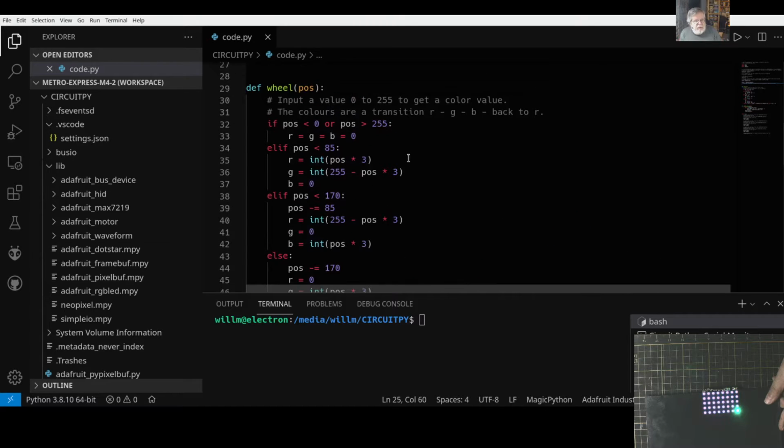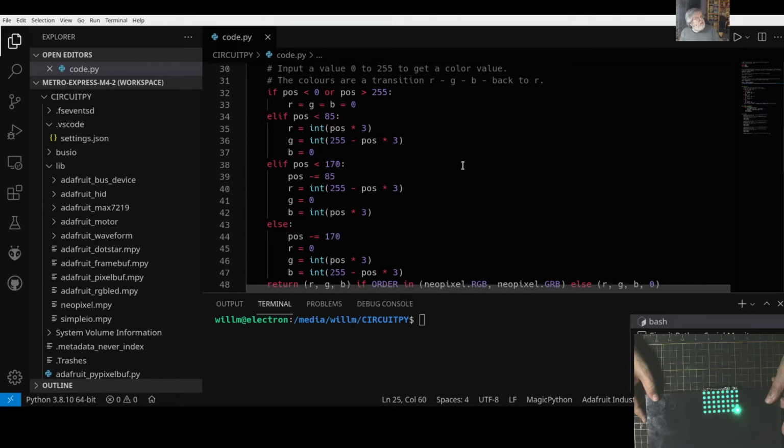And this is just determining what position you're in. You can figure this out pretty easily. They're just setting red, green, blue to 0, for example. They're starting at position 0 in the color length. It's fairly straightforward. This makes it really easy to code. And this is no different doing strips, bigger matrices of NeoPixels. They all work exactly the same way. In fact, you can take this off this board. I could wire up one of the ones with the 3 wires, and power, and I put it on 6, change the count, and it would do exactly the same thing.